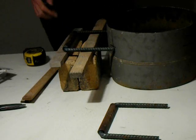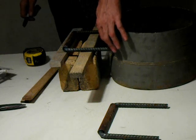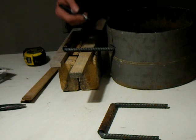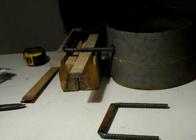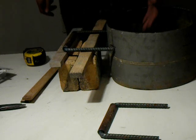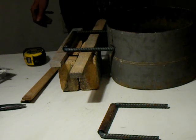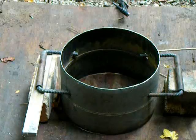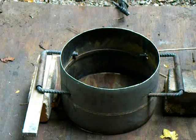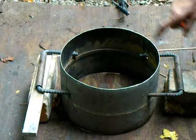We've got the handles bent and we just kind of line them up about two and a half inches from the top — it can be anything that you find comfortable, it doesn't really matter. Just try to get them as even as possible. We're going to cut two holes in this with a Dremel tool, shove them through, and weld them together. We're going to make sure they don't stick past about an inch inside, not past really the insulation. Now we've got everything set up — just put the spot welds and then do a solid weld on the inside and outside to put the handles on.